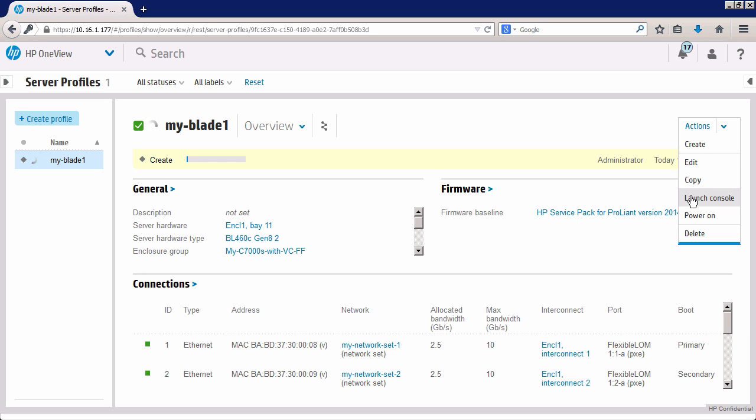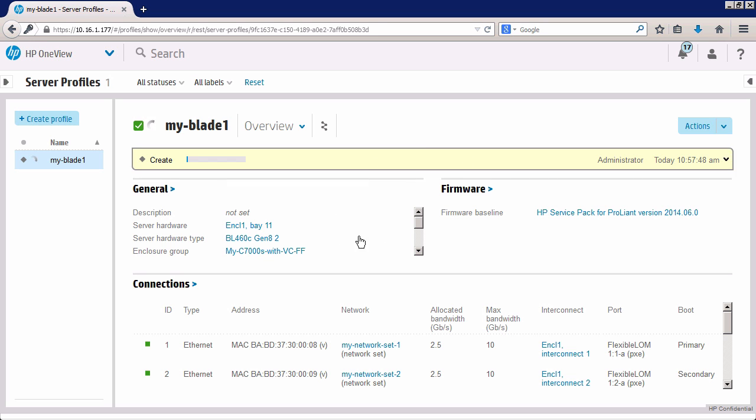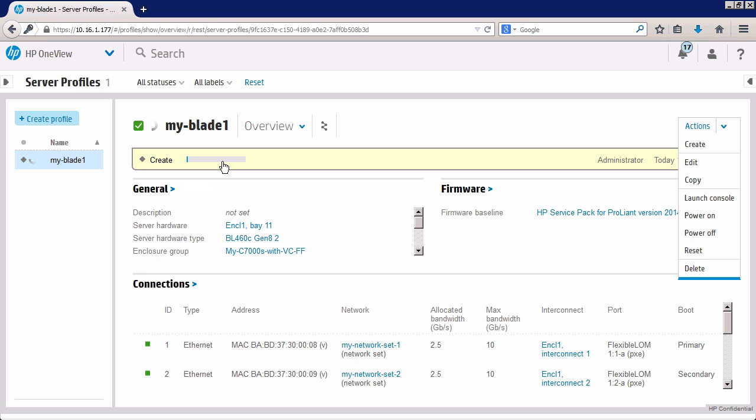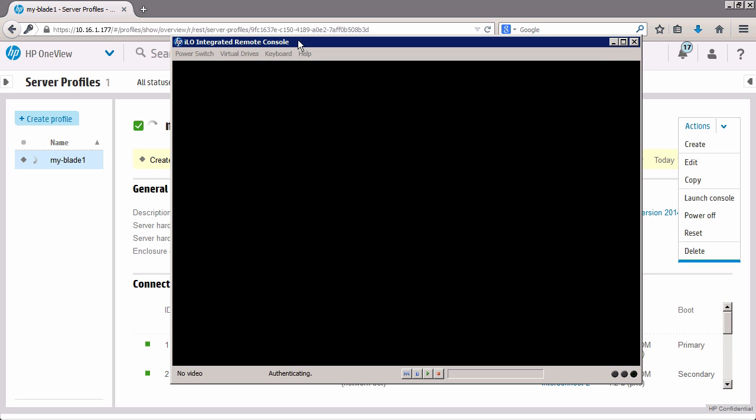If you have real hardware, pretty much you can launch the iLO here, because this is a simulation, it really doesn't do anything, and so you can monitor the process of this booting. Actually, it did. That's interesting. Good. But if it's real hardware, you will see it's booting, ProLiant reload and going to the Linux service OS, trying to provision all of the above parameters you provisioned.